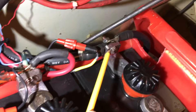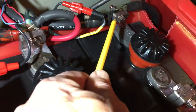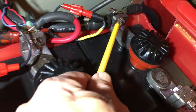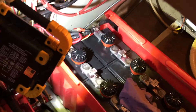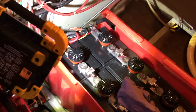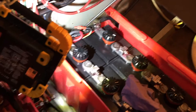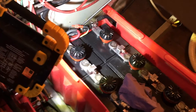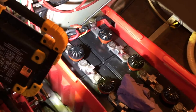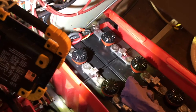This is the negative terminal on our starboard battery, so we're going to remove that nut, put the connector underneath it, and then re-tighten it. Before you proceed with this next step, make sure that your battery charger is turned off completely. Also remove any jewelry — rings or watches — you don't want to accidentally create a short and have sparks flying.